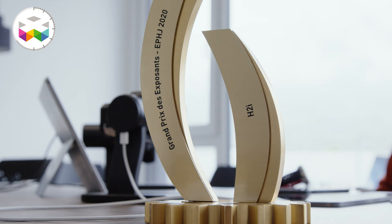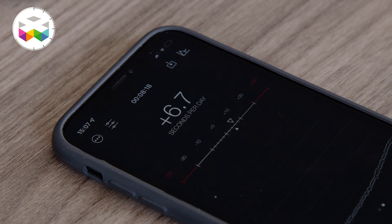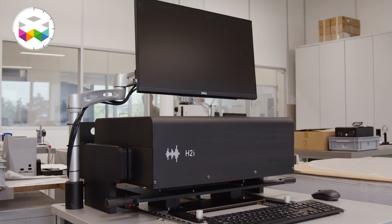The idea behind those products is to be closer to what a watch experiences when worn day after day. Acoustic measurement is something very instantaneous — it gives us a trend about how the watch seems to be at that very specific moment. But it doesn't tell you anything about what will occur in a few minutes, tens of minutes, hours, and more. So for long-term precision measurement, we use different kinds of tools.